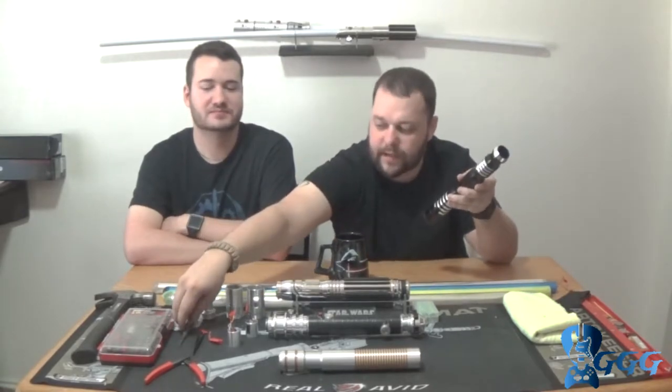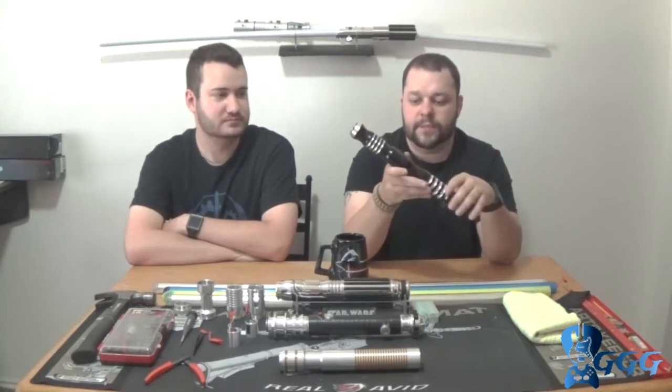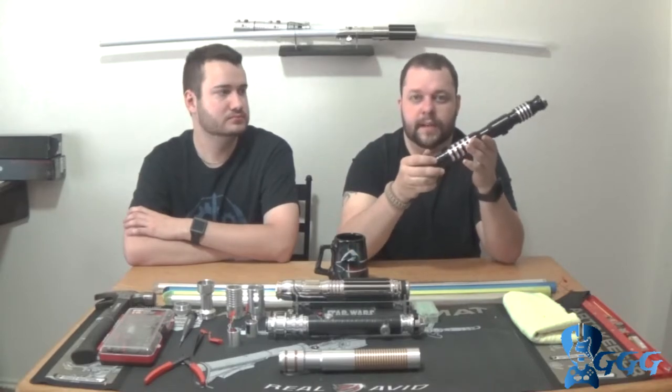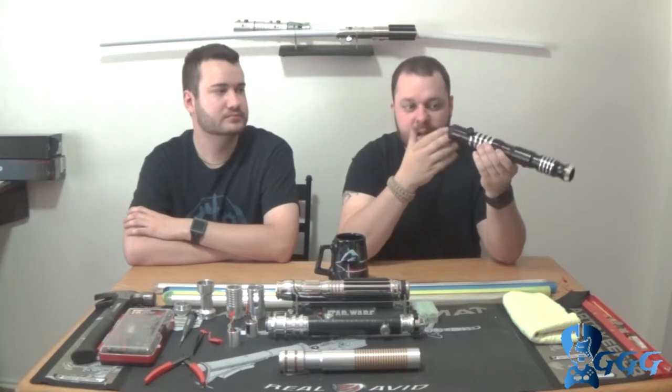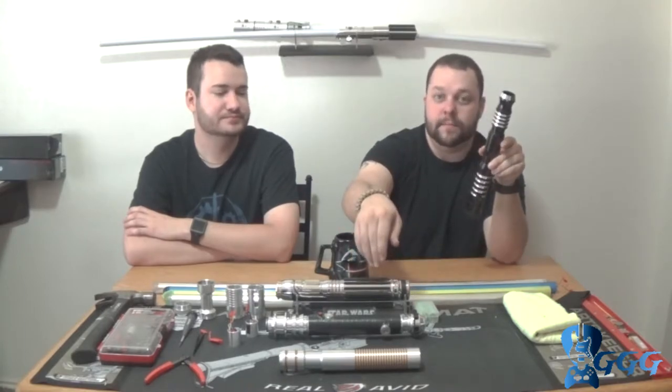If you go to the Obsidian V4, which is what's in this right now, you get the option to select and change your sound fonts on the computer, and you get two, I believe, 3.7 volt rechargeable batteries, and it puts out a 7.4 volt charge. So this soundboard is a little bit brighter than this one, because this one's using AAAs, unless you put some rechargeable batteries in here. This one comes with 7.4 volt output. It's actually got a buck puck on it.